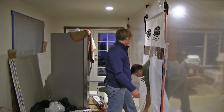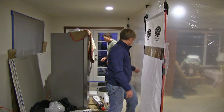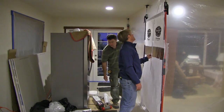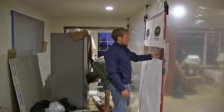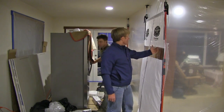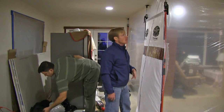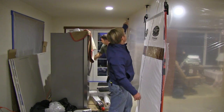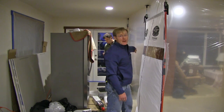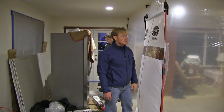When you let the door go, the magnets hold it together. And in this case, we have a little bit of positive pressure on the other side, which will be even better for keeping dust on this side. By stretching plastic and using a little heavier plastic, stretching it tight down the sides on the walls and across the ceiling, we'll have good dust control.